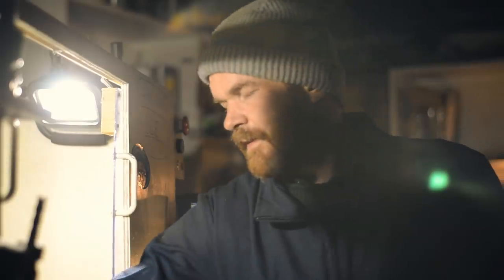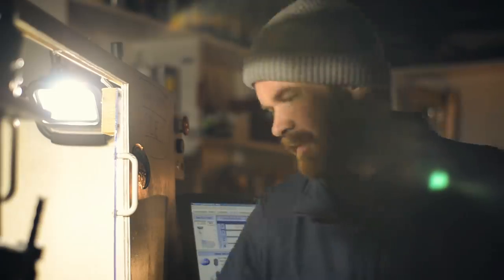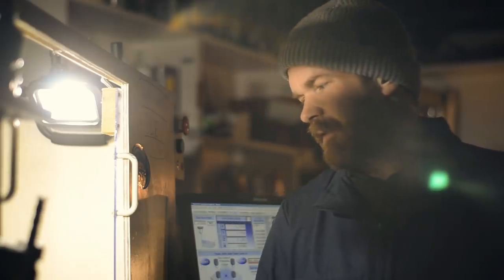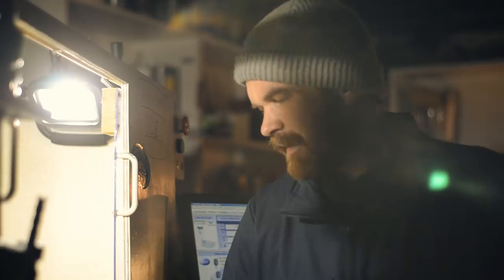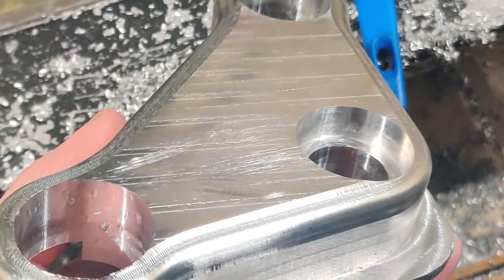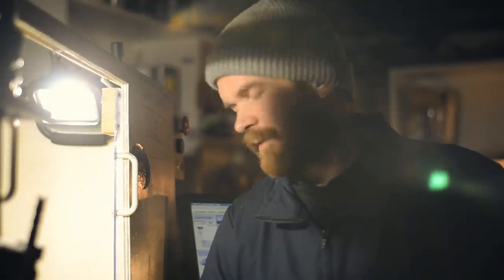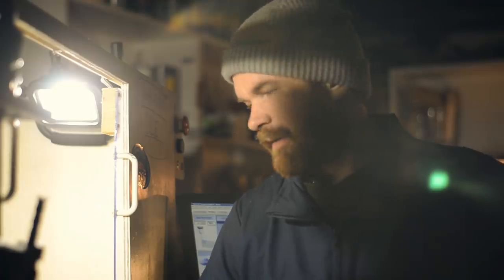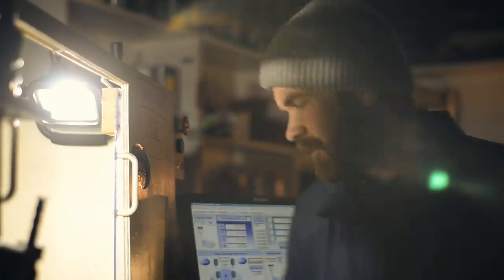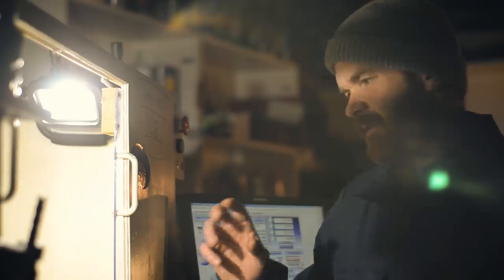The spindle is running fine after I tightened up the bearing preload. Yet to see if it makes a difference. This test in wood turned out exactly like the aluminium counterpart. That step between the face and the bevel around the outside is something with my programming, not losing steps, I think. I forgot to set my probe at the known good surface and note down the number. So while I re-zeroed now, it was in the ballpark.